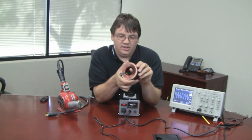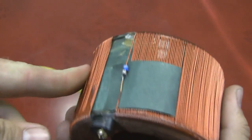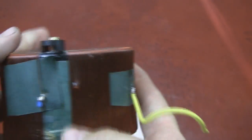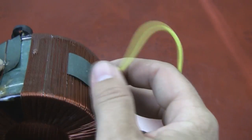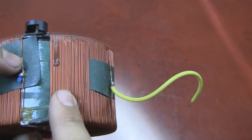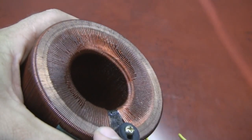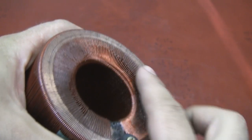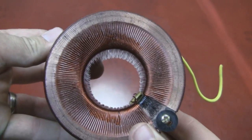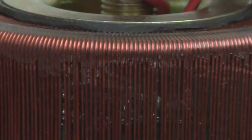I have a core here out of this variac — let me show this to you. You can see this is just one continuous wrap of wire wrapped around a core, and you've got two feed points here. You'd feed your neutral here and your line on this one, which is where we have these wired up. You'll notice there's actually more coil beyond where the line connection is wired in. On the top of this you can see that the varnish has been shaved off and we have exposed copper. Inside the unit there's a wiper arm that follows across the top of this and allows you to pick anywhere along this coil to get your output voltage.